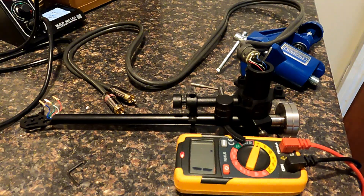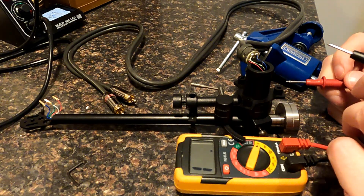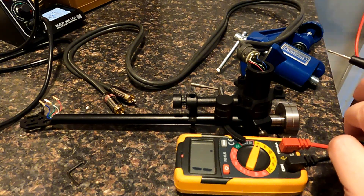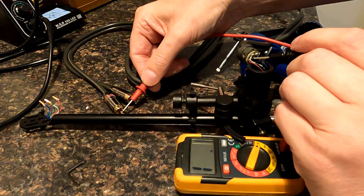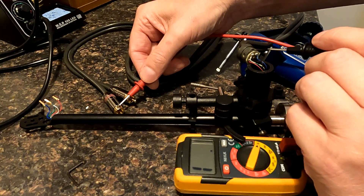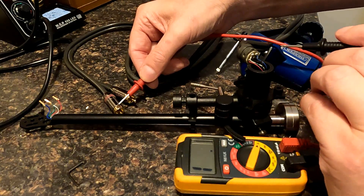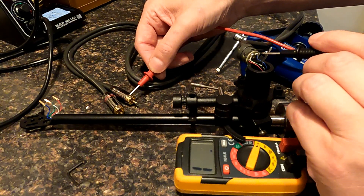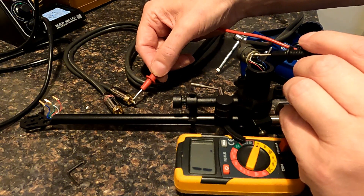Right, having retrieved my post, I'm just going to check from here to the other end to make sure we're not being misled by anything. We know red positive works, so we should get a beep — yep. Right negative works — yep. Left negative, blue — yep. And then we've got this one, which should be dead — yep, completely dead. So what we need to do is replace that cable.